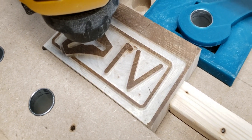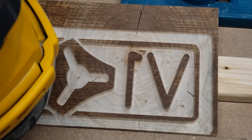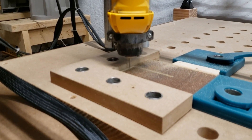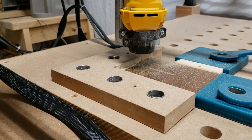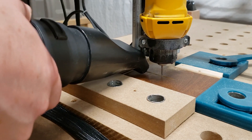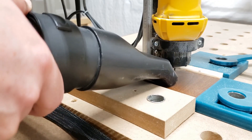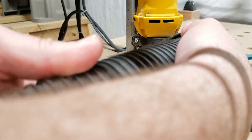Here we can see an artifact that was left behind after the clearance. I'm not sure why it left that small piece there. It was pretty clean once finished but that little artifact I had to cut off with a scalpel. For the female part, everything was cut with a 30-degree cutter. I set it for a 0.5mm tip, so the software thought my pointed 30-degree cutter had a 0.5mm tip and adjusted accordingly. The final finished part required very little cleanup — I just took the scalpel and removed any burrs.